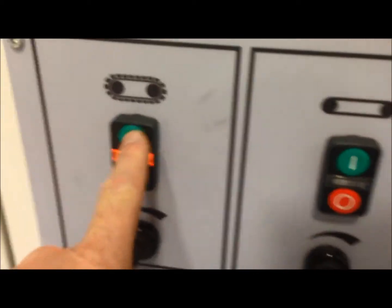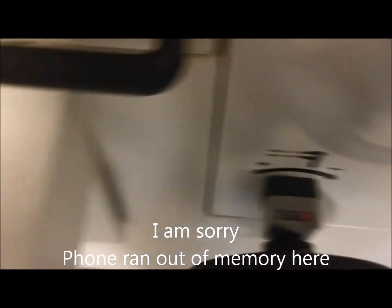Then what you would do is you turn the machine on and you time how long it would take for the part to disappear, from where the tip is just reaching, just disappearing underneath the hood, and then the tail also disappears. As you will see, this time is approximately 6 seconds. We are turning the conveyor belt on. I have the conveyor belt sitting at 7. We are grinding at a very light tension of 2, and the material thickness I entered at 1.2.